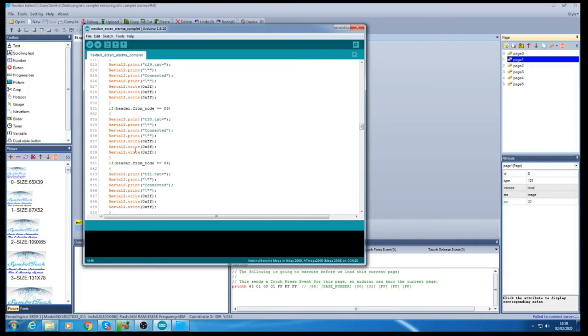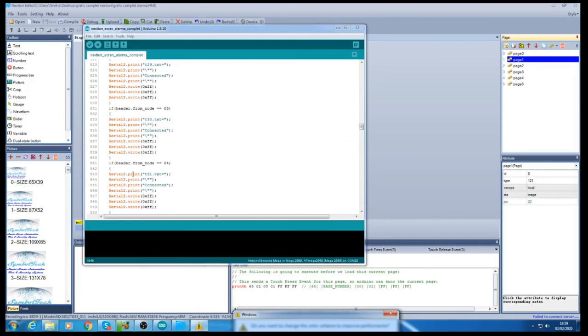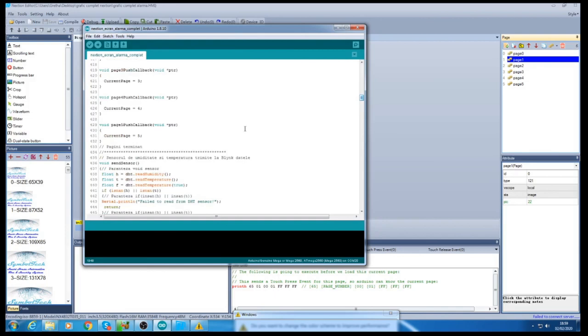Like, you are in the living room, it detects you in the living room, and it allows you 1 minute after the beep, where the panel does a not-so-loud beep, it's not at high volume. So if you are the one and you think, oh my god, I forgot to scan my fob, it allows you to go to the panel, put in your pin and reset the panel in order not to go to full bells. Otherwise, if the pin is not inserted, it will go straight to full bells, so it will ring.